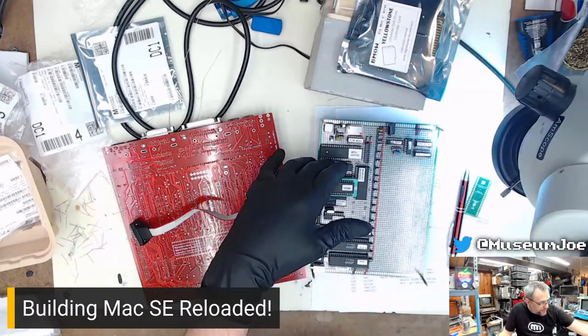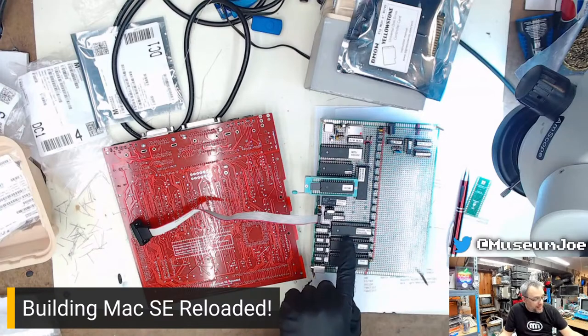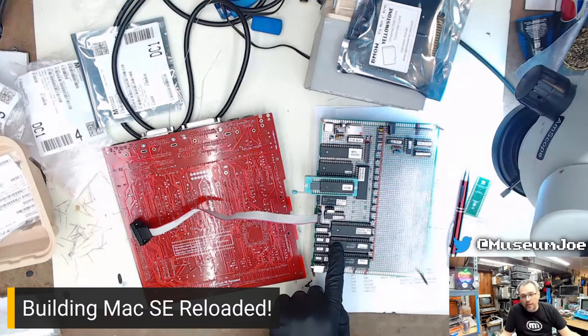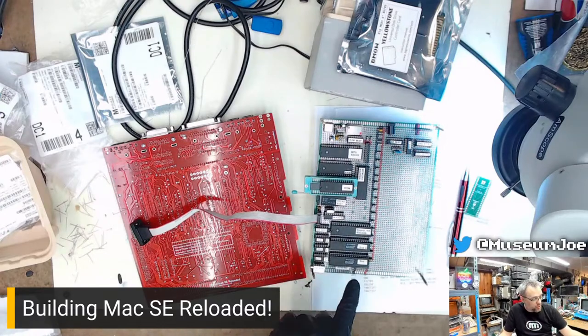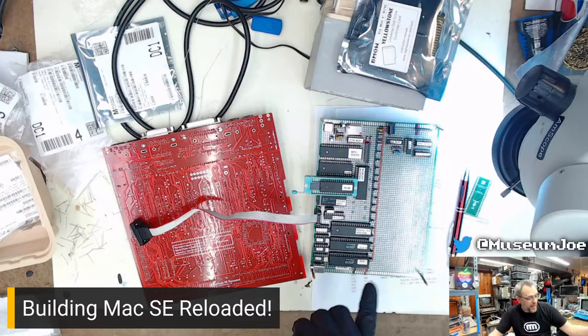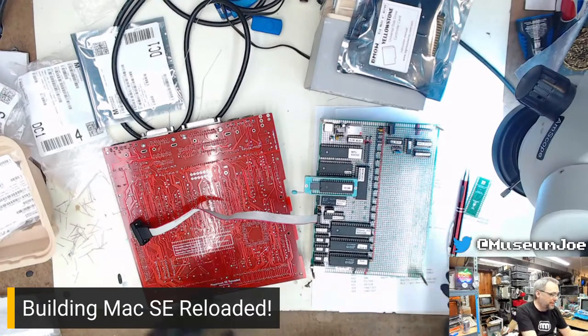This thing has joypad controls right here, because the AY3s have extra input-output pins. So I'm using the VIA to control the AY3s to control the input-output pins. So it has Atari compatible joypads. It's cool. It's going to be this cool little 8-bit whoop-de-doo. It's going to be great. I just got to finish.